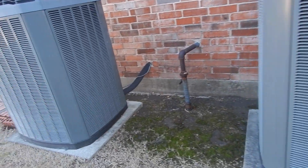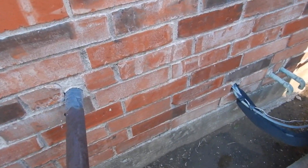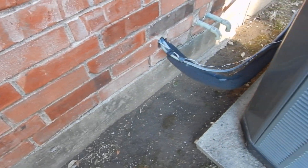We're over here on the north side of the garage. This is the gas piping coming into the house. I don't see a bond on this pipe — it's been wrapped. It'd be better if it was painted. I don't see a main disconnect for that either.